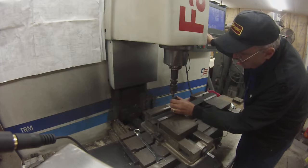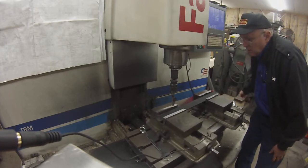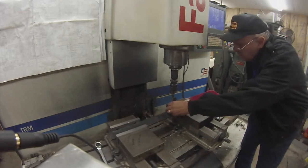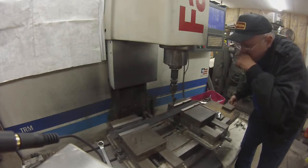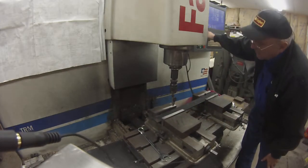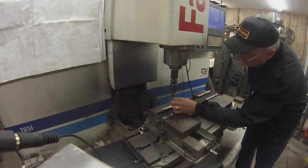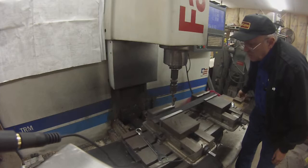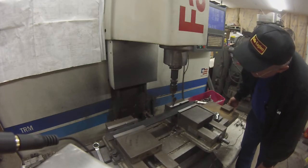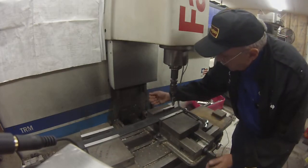Okay, double check this one. This is about a half out. Head for the other vise. I got too much pressure on the indicator, so we'll back it away. So we got about 10 thou pressure on it. I'll head for the other side. Okay, and that is minus a half a thousandth there. Minus a thousandth there. We just bump it a little bit.